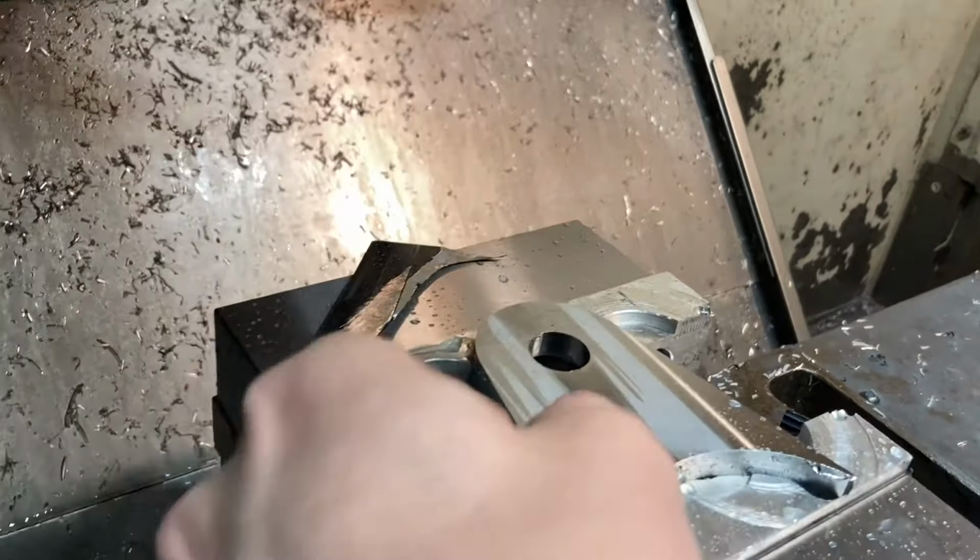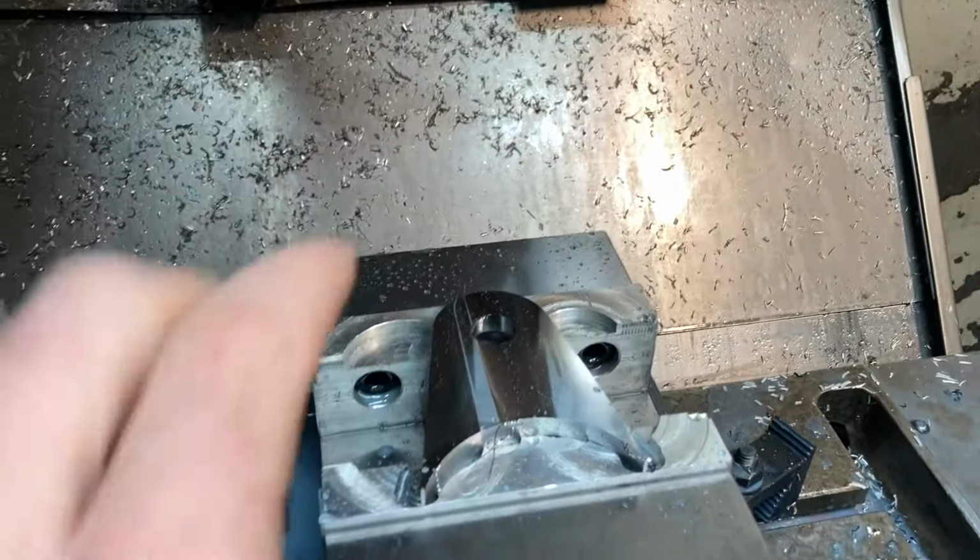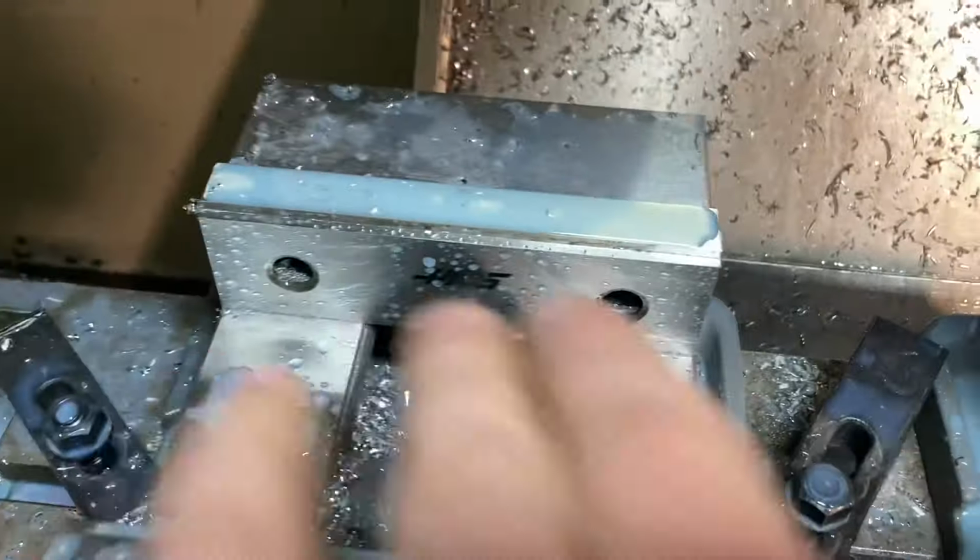Like that, face mill program is done. I ran it once and then I did have to drop it again to get my thickness right, so I just finished running that. These things vibrate super loud as they're ripping off the little extra flap from op one, but go ahead and things are on optional stop right now.